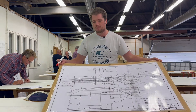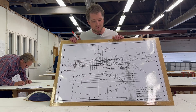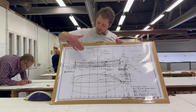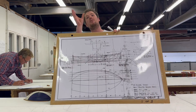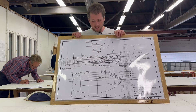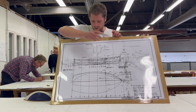We start lofting by drawing a grid, as you can see here with these straight lines, but all of the grid lines on a lofting also appear in another view as a curved line. To explain the three different views: I've got a profile view here, which as the name suggests is the view of the boat from the side. I've also got a half-breadth view down below, which is the kind of fish-eye view if you were looking up from below the boat. And then I've got the body plan view in the middle, showing the boat as if looking from the front on one side of the centreline, and from the back on the other.